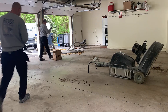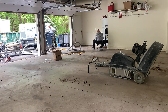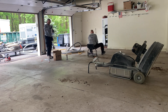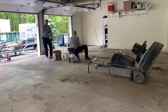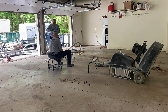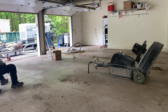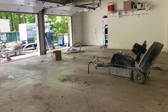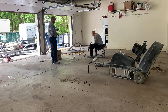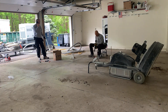We're going to fill all these joints with polyurea, grind the whole floor, and get ready to coat. We do have some cracks to fix as well. I always sit on a wheelchair when we do this — it just makes it much easier to fill the joints. I'm rolling around while Jeff gets the tubes ready as I fill with our DeWalt gun for the dual cartridges. As soon as we're done with these joints, I'm going to repair those small cracks right in front of the garage doors with the CFS 343.